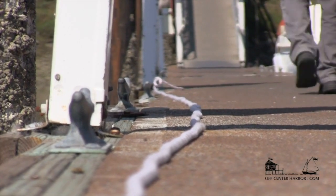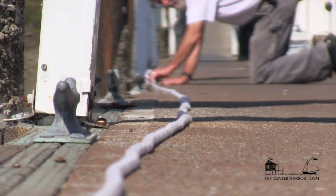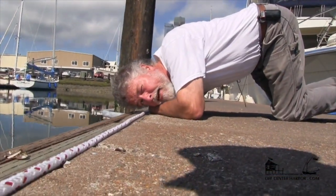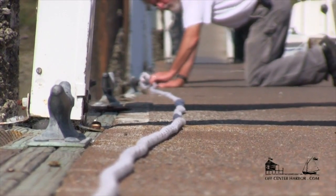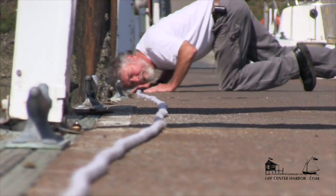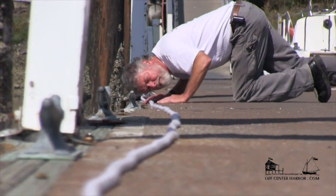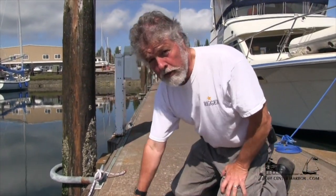Sort of like that. Then you go all the way to the bottom end — this is where the bottom of the jib stay would be — and put the side of your face on that stay and sight up it. And if you hadn't just measured how far from the straight line that curve was, you would swear it was a foot and a half. But now your eyes are calibrated. You can sight along that and now you see what five inches looks like thirty-some feet away. Most people don't know what five inches looks like up close, so you really need to get calibrated.